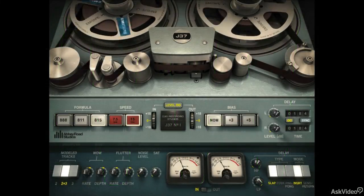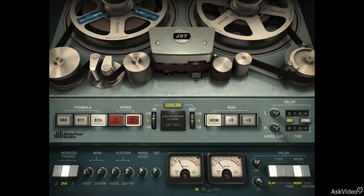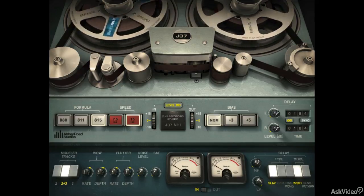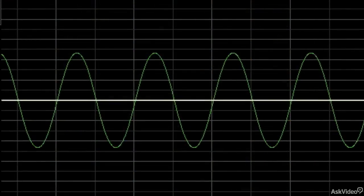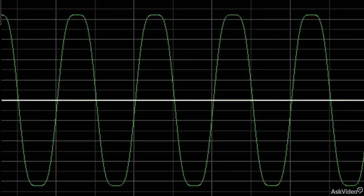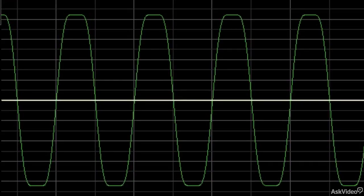Now, when this happens in digital recording, the clipping is not gradual, but abrupt. The result is a sudden onset of nasty, spiky sound, unsuitable for anything but special effects. But the cool thing about analog tape is, when this same limitation is reached, the wave is gradually compressed and distorted. In small quantities, this will actually enhance the sound, making it thicker and fatter in a good way, and giving it more presence. Eventually, it'll become too much and sound nasty, but in just the right small amounts, the result is a uniquely warm, fat, present sound that's hard to simulate by other means.